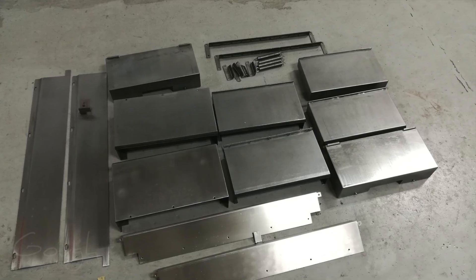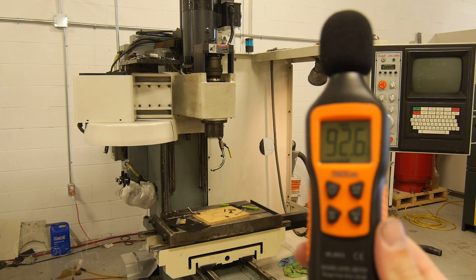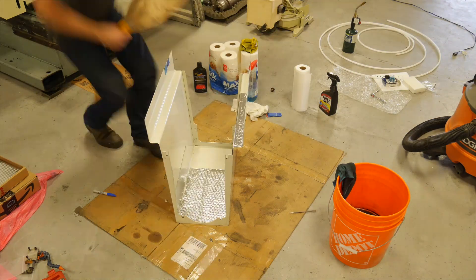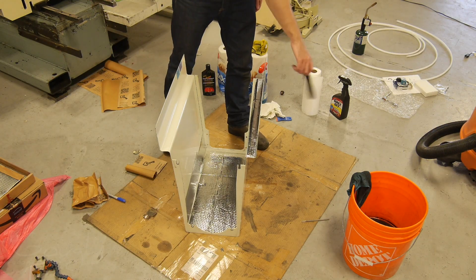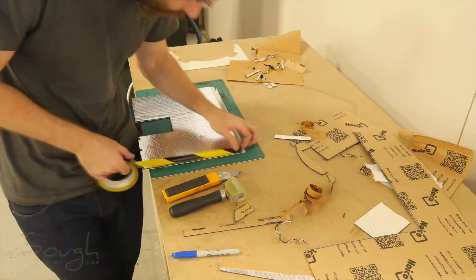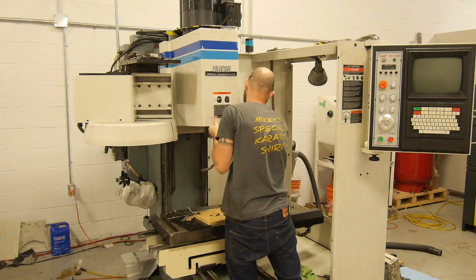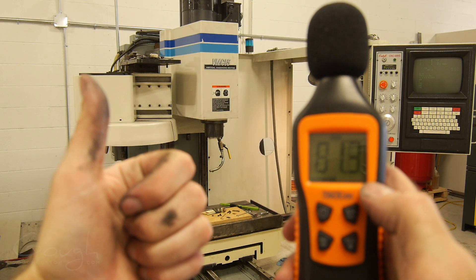These are small things, but it makes a huge difference to how the machine looks in the end. One thing that I discovered during testing was that the timing belt spindle drive mechanism in these machines is incredibly loud — without the head enclosure attached, it's actually around 93 decibels when running at 7,500 RPM. I decided to try fitting automotive damping panels inside the head enclosure to see what difference they would make. The difference was immediate and huge, so I decided to go ahead with fitting all of the head enclosure panels with the damping sheets. Adding the damping sheets ended up getting me a 10 decibel reduction in sound at 7,500 RPM, which is huge.